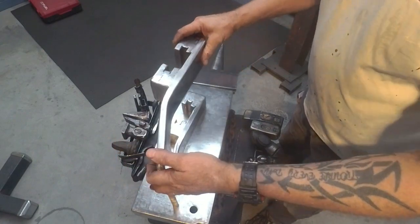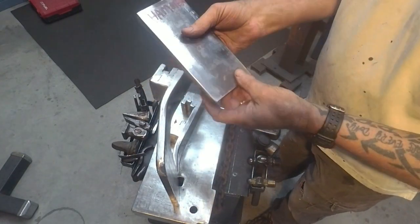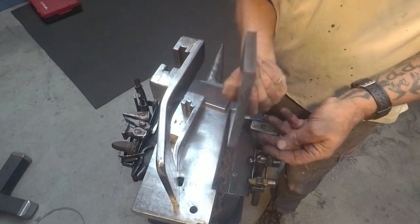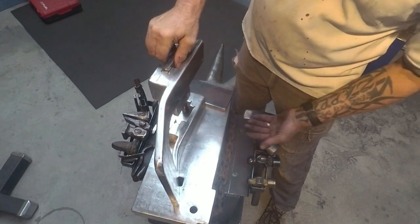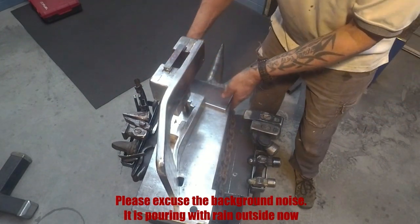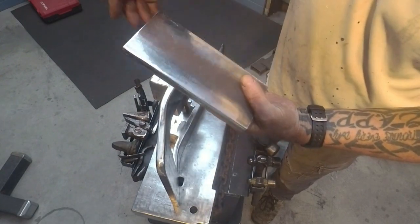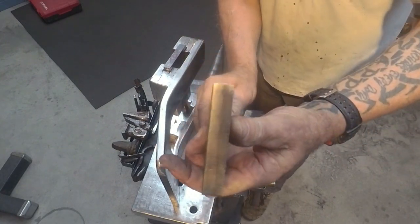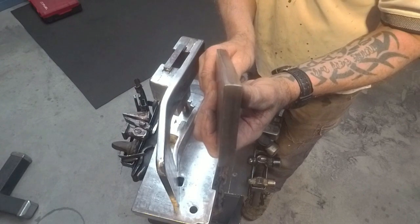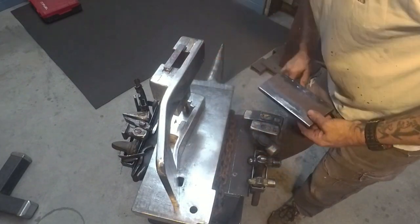That piece is made and I've now cut my first two dies — they're just cut out of the steel. The dies aren't put in the shape that I want yet; that's just a straight fuller. This slips in there and drops down to the appropriate place. I've got it just a bit thicker at the top so that it doesn't go all the way in at the moment. I get in here with a worn-out flap disc and just take a little bit off the edges where I feel it needs to be taken down so it slides easily. Unfortunately this scrap piece of steel is not 100% dead straight — it's got a slight bow, probably only a millimetre or half a millimetre — so I've had to take a little bit out of the edges.